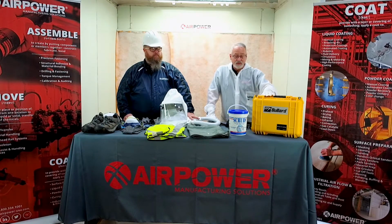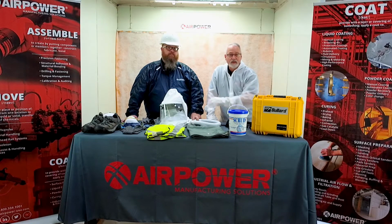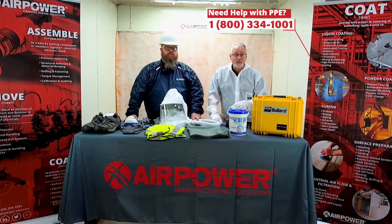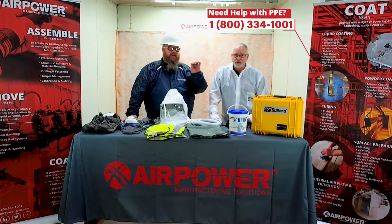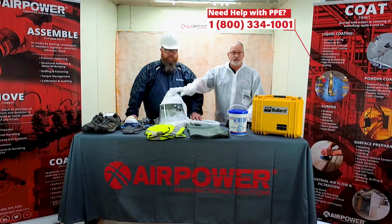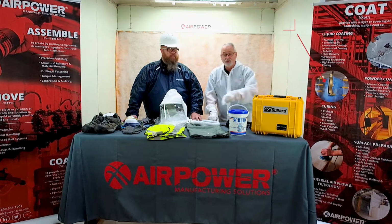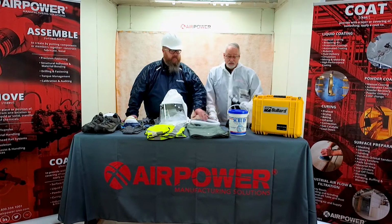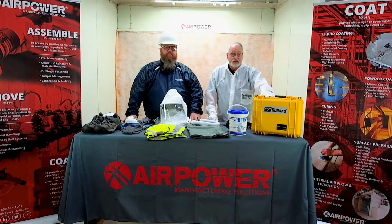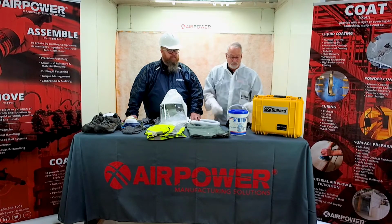One other thing with this is that from the box unit, from this unit out to the hood, has to be the same brand. So from the hose to the nose has to be the same brand. Not because we said so. That's OSHA. So you're going to have a rubber hose that goes to here. It has to be the same brand as this. This happens to be Bullard, one of our partners, and then this is Bullard, one of our partners. So you want a Bullard hose to connect these two. That's just the way the fittings are. And your cool tube has to be Bullard. So everything in line downstream of the filtration and monitoring system has to be the same brand, okay? No matter whose brand it is, it has to be the same brand.